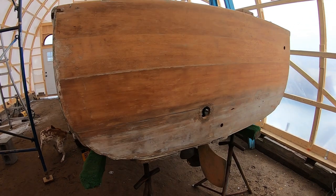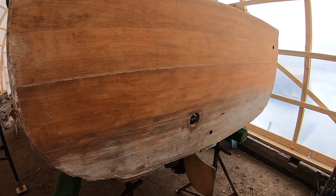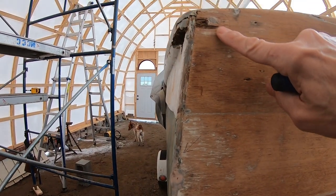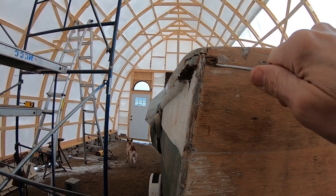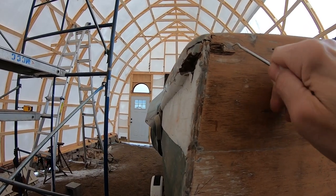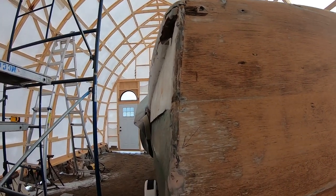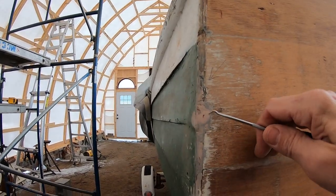Last night I got the transom sanded off quickly with 80-grit, just to try to figure out what the problems are, and I've marked a few of them. You can see right here we've got just a little spot with some rot — it goes in a little bit there, we can clean that up. There's a couple of pieces here that look like an old screw spot. I think that's just a small Dutchman — maybe only go down halfway to get rid of that.